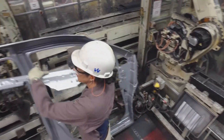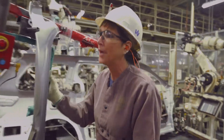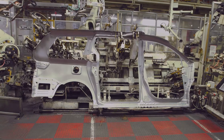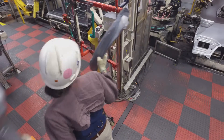I'm going to set those on the two guide pins, and this part I'm going to set here on two location pins. When I do that, you can see I get a solid white light, which means it's okay for me to press the start button. I'm going to push this button, and those parts are going to transfer back, which allows me to then go ahead and pick up the three remaining parts and install those on the side member.